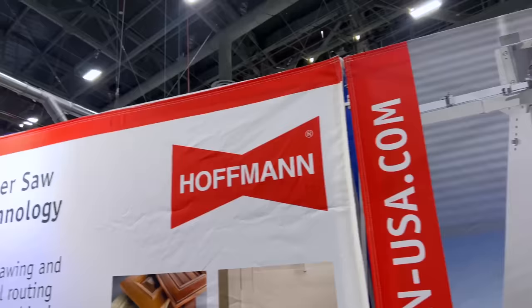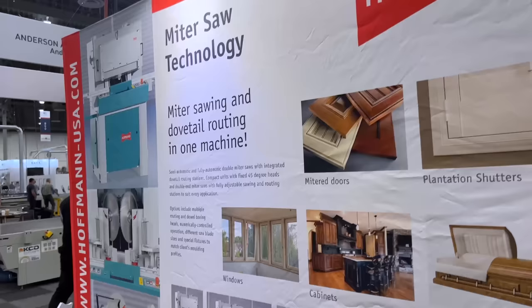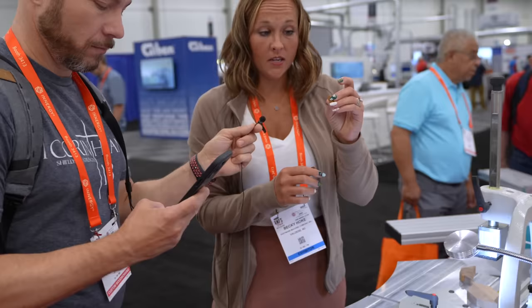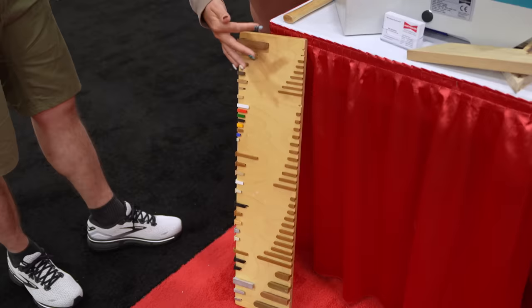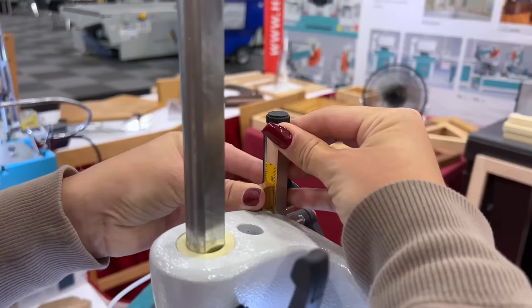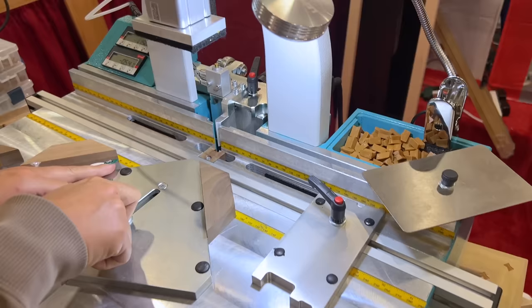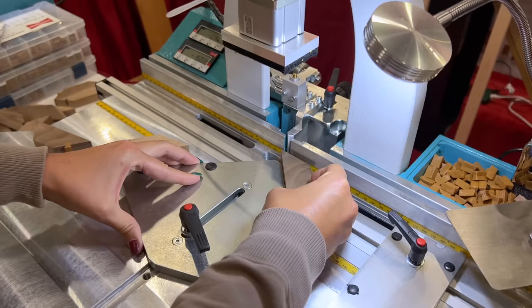I'm with Becky Hoke with Hoffman Joinery Systems. She's going to give us a demo on a machine that makes making frames and other joinery much easier, faster, simpler, and all around cool. The easy way we do this is with our keys. Once you figure out the size you need — you can see on our keyboard right here we have the different lengths. This is the main one, the five-eighths, the one most people use. That's how you set your depth. You use your key, set it right here, line it up, and lock it down. You can see that acts as a stop, so that's how it's going to come up and route from the bottom. You move this plate and set it up here and you're going to have a mirror image, so it's going to cut at the same spot.